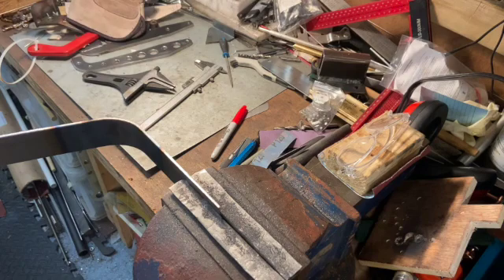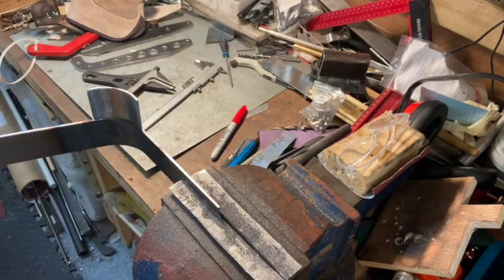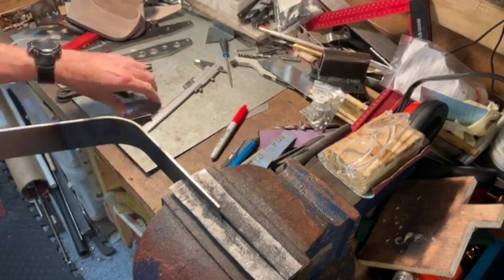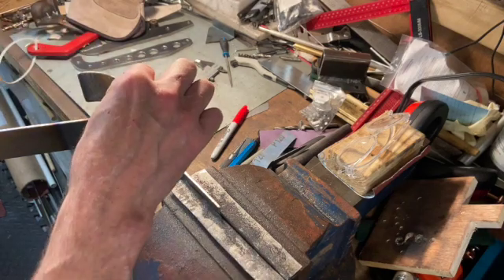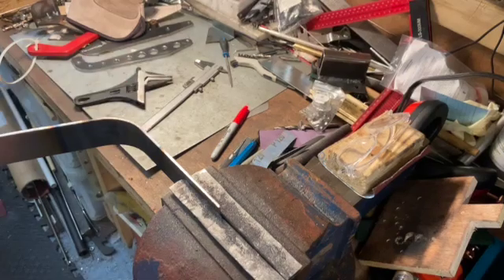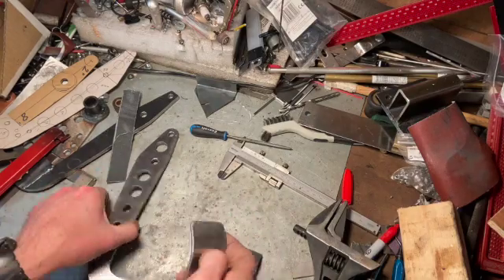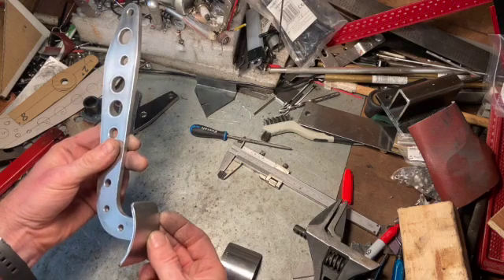Metal bent. Without branding myself I can just offer that up — that is about right. Slightly tighter, but that doesn't matter. I could try and bend it out a bit more. Yeah, that's fine. Right — let it cool down, cut it, fettle it, file it, weld it. A bit more fettling later: old spindly one, new chunky one. I've curved that slightly and I just need to weld that on there now.